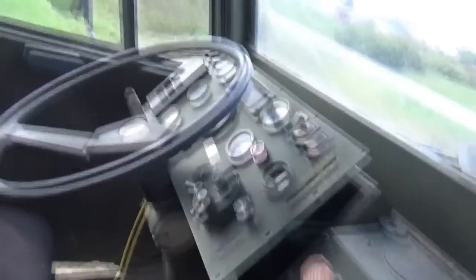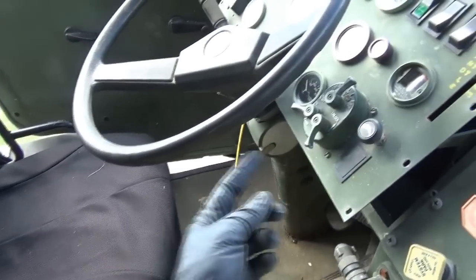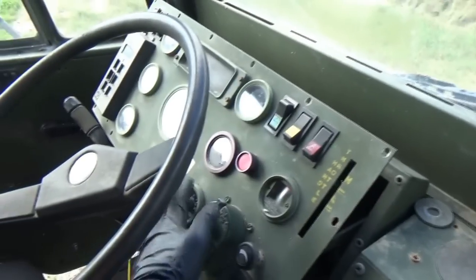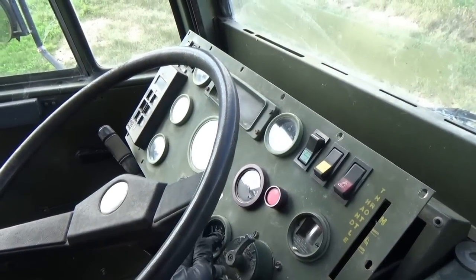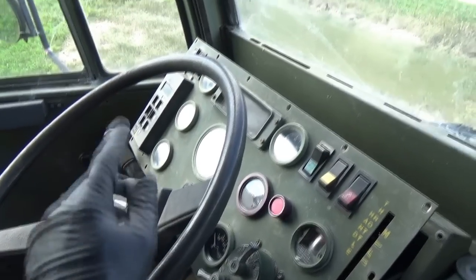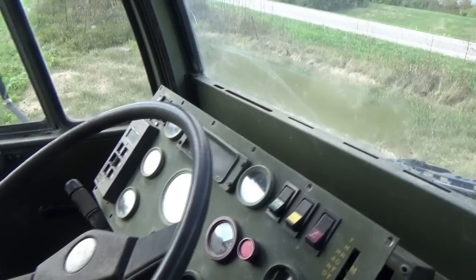The water gauge, yeah, I measured all the gauges with a bypass test, just like we just did with a test light. You can ground the signal wire and the gauges all jump to their max. So the water one, I think the engine just needs to run for a while. The signal was dropping, the voltage was dropping, and this needle was, I think, starting to climb. So let's fix the fuel gauge right now. And then the last one will be the oil pressure.